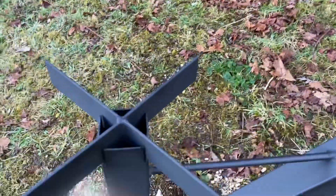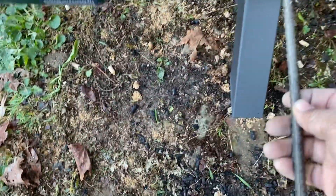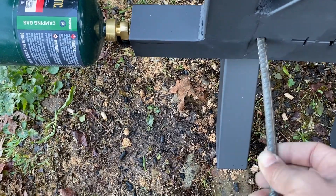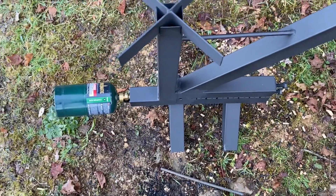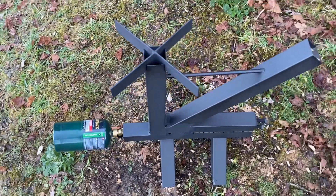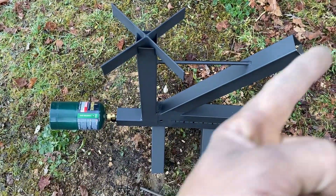While that's going, I'll tell you about the only tool you're gonna need for this. You've got the smoke, the primary burn chamber, secondary burn chamber engaged. This piece of 3/8ths rebar fits through this hole — you go in here and give the burn tray a little wiggle. That'll drop your ash into the burn tray, and that's all you've gotta do for maintenance.